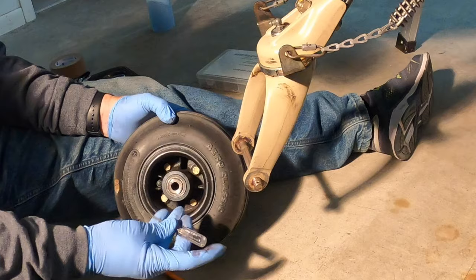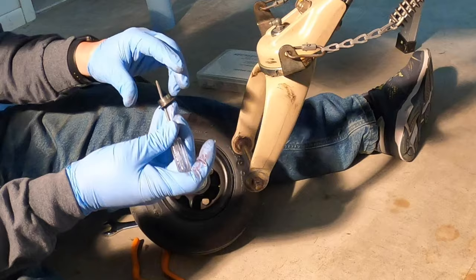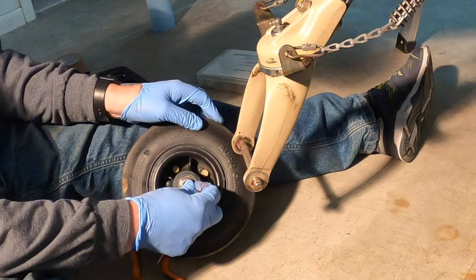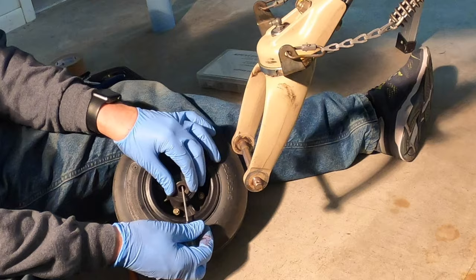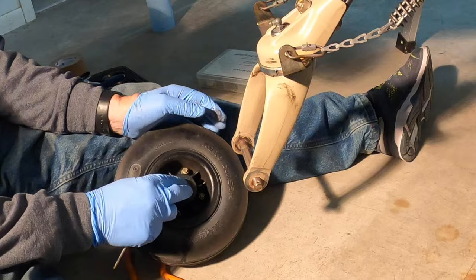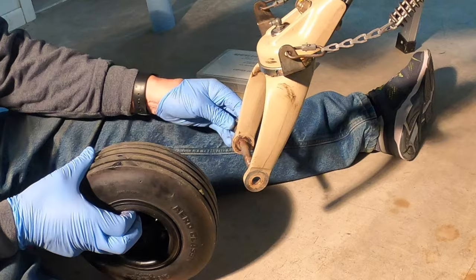You can see inside the wheel there's a bushing right here. We pop that out and look at the bearings — they've got plenty of grease in them and the bushing looks pretty good, the face of it doesn't look boogered up or anything like that. Turn it around and look at the other side. A little grass there with red grease, but the bushing looks good, no wear. Look inside — no wear there either. So we can set all this aside and we'll add grease to it later.